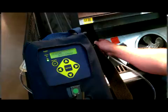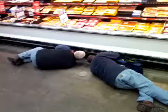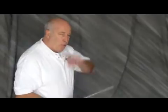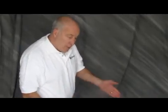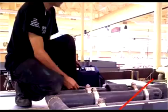You may want to go look — a lot of times it can be wafting out from behind a case or under a case. Think about it: if I'm refrigerant and I'm leaking, there might be an air return that's going to affect things, or shoppers walking through and wafting the refrigerant around. If you get a hit, there's a leak somewhere. Overhead pipes — a lot of times the pipe is up top and you get the leak down at the bottom. Look for oil stains. I guarantee you, use this unit on a regular basis and you will lower your leak rates. It is by far the best unit out there.